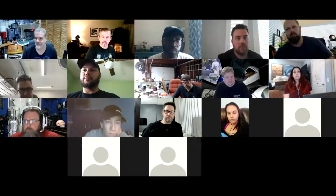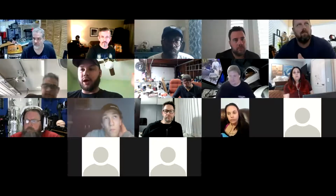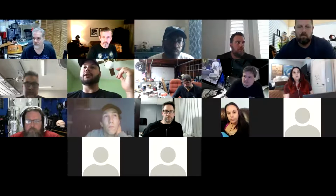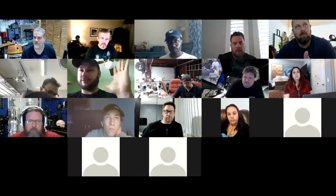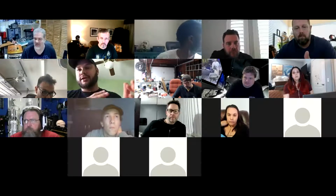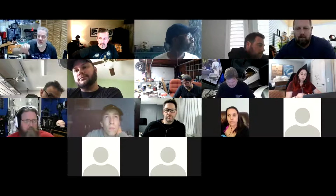So it was more the ability, for Wally for instance, if I want to make him go like this when he says something, I can hit that. He'll do that as long as my hands are off. And then when he's done, I can go back to individually animating him, seamlessly. The person watching him doesn't know it went from a pre-scripted bit back to individual interaction. Yeah, exactly. So all the servos will be at center. You will get the head level, centered, and the neck maybe halfway up. Then you script whatever you want to do. If you need to take control over it, you just go ahead with the stick. And yes, this will work great.